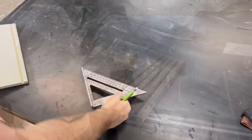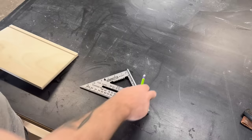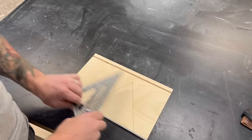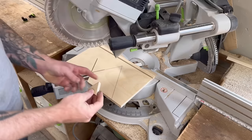I'm going to make a three-legged stool, and I figured the best way to figure out the positioning of the three legs would be a triangle — but not a right triangle. What I need is an equilateral triangle, meaning all the sides are the same length and all three angles are 60 degrees. Using my speed square set at 30 degrees — because that's half of 60, and that's what you have to do to draw an equilateral triangle — I drew one side over here, one side over there, and boom: equilateral triangle, all three sides the same length.